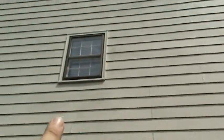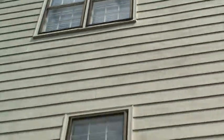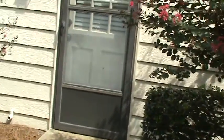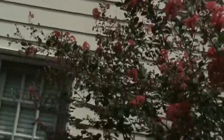We're at the basement, right side to the rear. Here's another example of the wrinkling that goes on with rotted wood — you can see this on your house and just know it's rotted out. We've got wrinkling on the second-story window and on the third story as well. And if you've got Masonite or manufacturer siding, don't let them get out here with a gas-powered 3,500 PSI pressure washer. Use a little electric unit, hand scrub it, light pressure rinse. Otherwise you're just injecting water into the house.